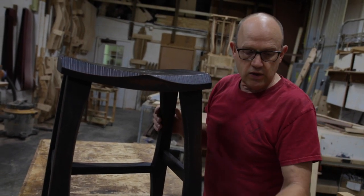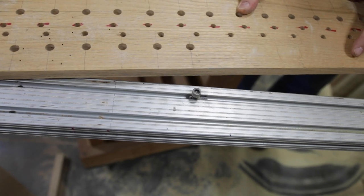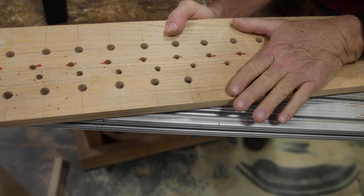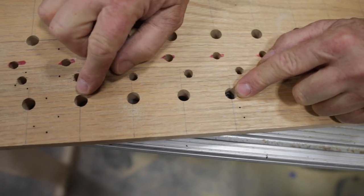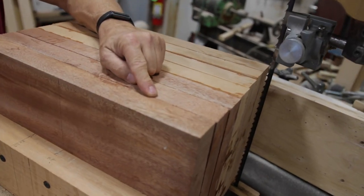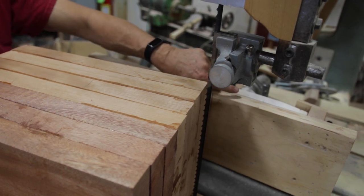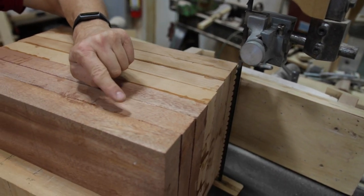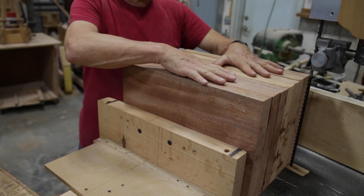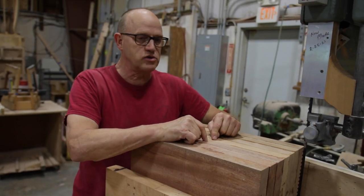What I'm doing here is I've got this set up to swing from a pivot point in this extrusion material. I've got a pin set in there and I'm going to set this hole on that pin. Each of these holes is spaced the exact distance of the thickness of these pieces. I've set this up to start here — the second cut will be here, the first drop will be waste, and then every seat after that will be a real seat. I'll lose the cuts in the middle because I've got cherry here and mahogany here, so I'll have a sort of hybrid one in the middle that I might not be able to use depending on how it looks.